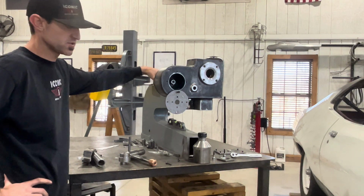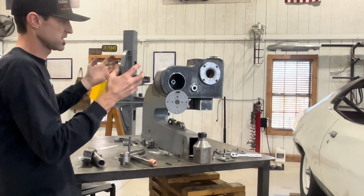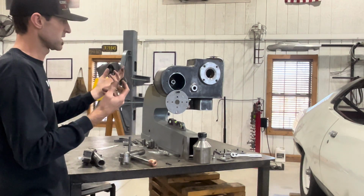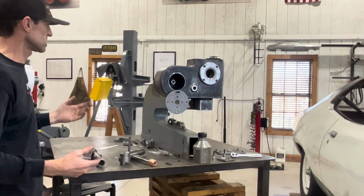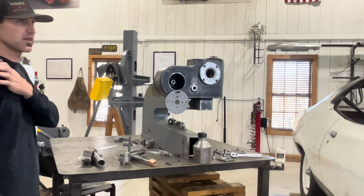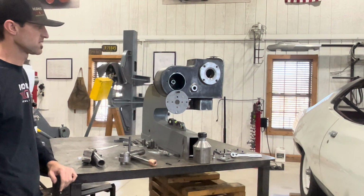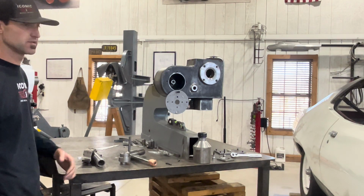Inside this back hub, which I'll grab the camera and show you, there's two bearings. I made a split housing because the way that the bearings go in, they're pressed in, but if I ever had to service them, I can on the back side. Like I said, I'm in the process of this. I know Pullmaxes are getting out there. They have numerous styles that people are trying to come out with. I'm just trying to replicate an original, but make it my own deal to accommodate what I do.